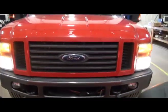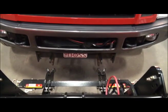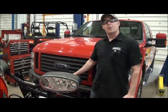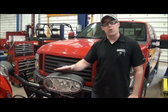The first step in setting this up is to align the truck with the plow just like you would do through normal setup. Once you have the truck and the coupler in alignment with one another, you'll leave the plow in the detached position like you see here with the lights forward.